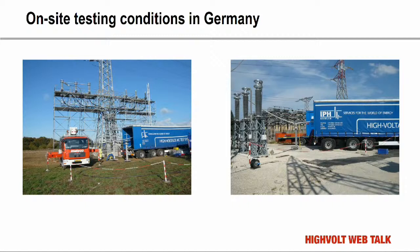If the cable is old, if it is a brand new cable, if you have a mixture of old cables and new cables — you have to understand breakdown mechanisms. For people not so familiar with that, they can look to the standards, which contain results from long discussions from manufacturers, utilities, research institutes, and test institutes. There you get hints on how to test on-site.